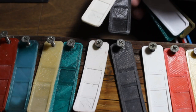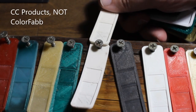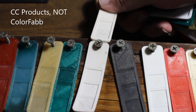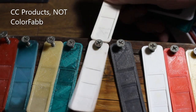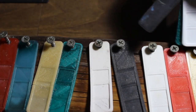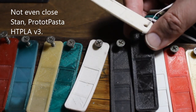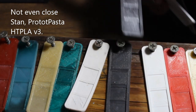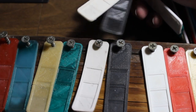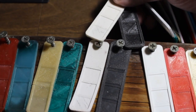Continuing down the list of oddball filaments, this white one here is Laybrick — a composite filament that was not very popular. It has a nice stony finish and my understanding is it's made with some sort of limestone powder, so it's a PLA composite. I always had problems printing it cleanly because it was really gloppy and messy. This one, if I remember right, is ABS carbon fiber. Other than being definitely dull in finish, it still has a lot of strength and is still fairly straight. Again, carbon fiber filaments really seem to stand out and keep their shape outdoors.